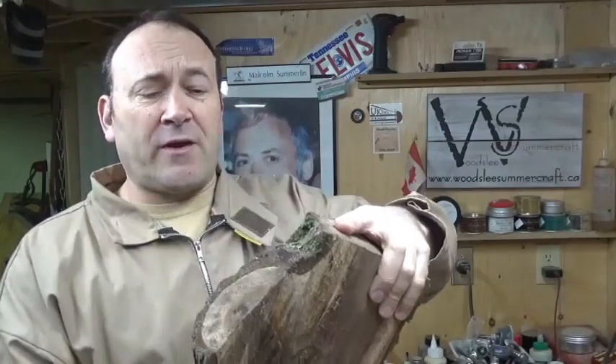This is still wet - I just brought it in from outside. What I tend to do is cut and prepare the wood and put it in black plastic bags, tie them up, and leave them in the shed or garage outside until I get a chance to process them. Sometimes that will end up with spalting the wood, but it's less likely to crack, which is the problem we run into when dealing with fresh wood.